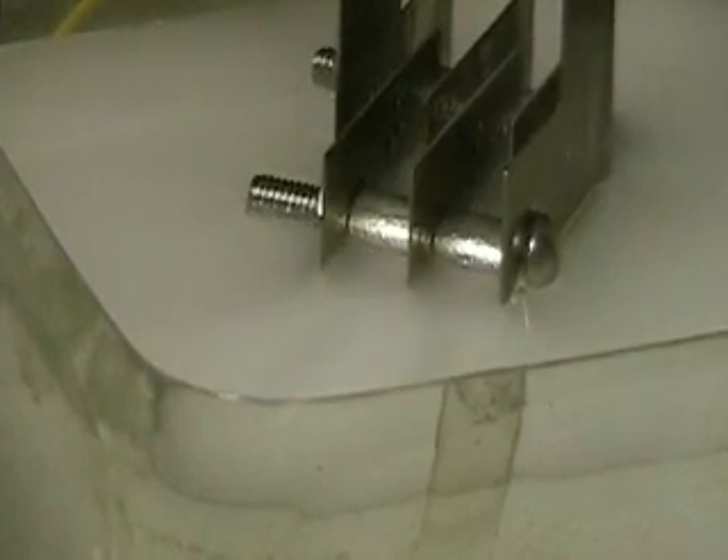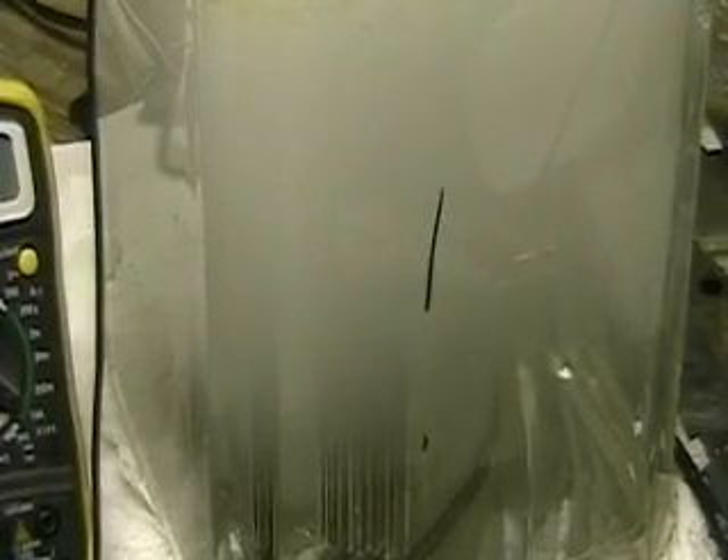This cell has six electrode plates in it — that's three positive, three negative. The rest of the plates are neutral, or I call them blank plates. It's every other plate that is a neutral or blank plate. The cell is spaced an eighth of an inch apart between each plate, and the plates are 0.028 inches thick. They're stainless steel.